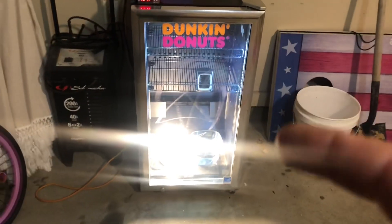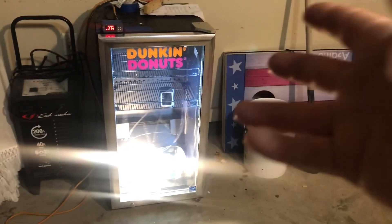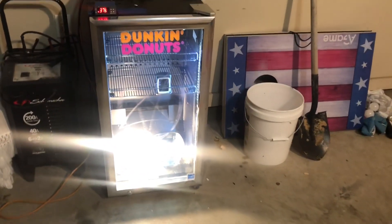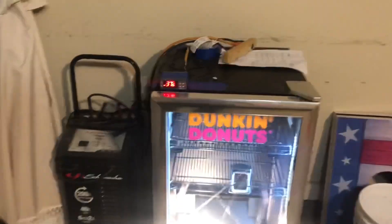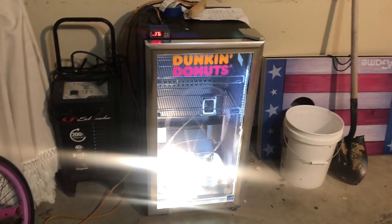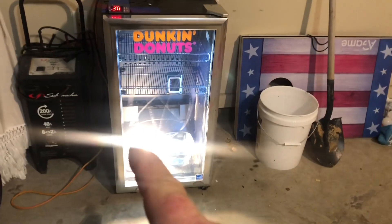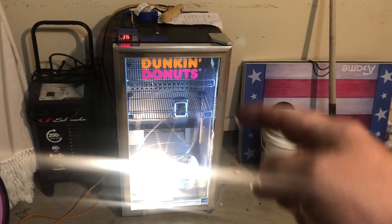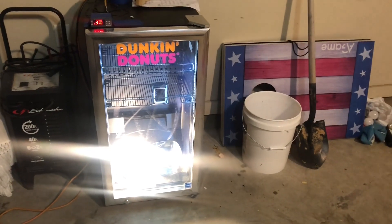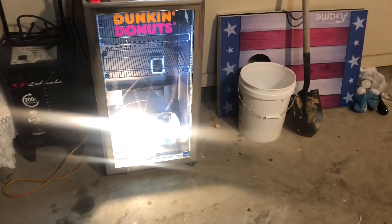Just a quick update - I opened it up and pretended like I was turning eggs. It took probably two minutes, and it is now climbing back to temp. It's been about five minutes, so it's probably going to be right around the five-minute range to come back up to temp after turning the eggs. One thing to note: I will probably put a second bulb in there, and that's because when I was moving things around I blew the bulb. And I got to thinking - if I blow a bulb my eggs are going to go bad. So if I put two in there and one of them blows, at least I won't lose my eggs.